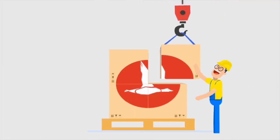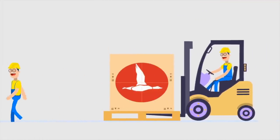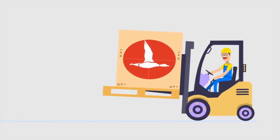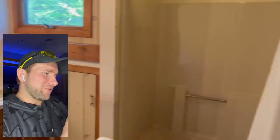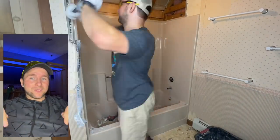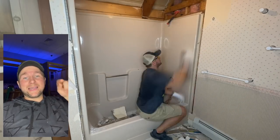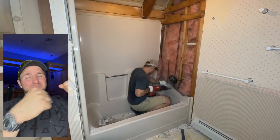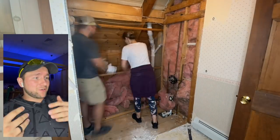So let's get into the video. Here it is — this ugly old bathroom. First thing you do is get into demo. You disconnect your fixtures and then you break away the sheetrock that goes around the perimeter of the tub, because there's a little flange that the sheetrock holds back. There are nails that run through — you pop the nails out and you can break it. I use a Sawzall to cut the corners. You want to make sure you can peek behind it to see if there are no wires or pipes.